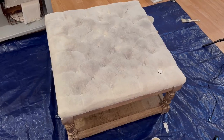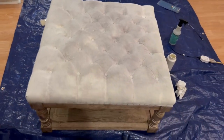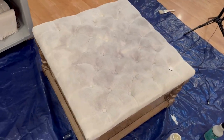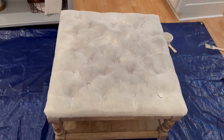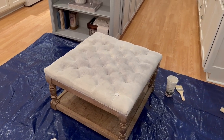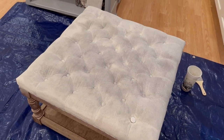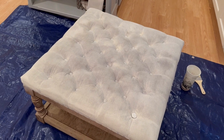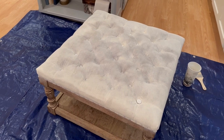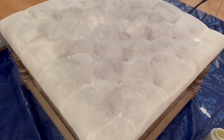This is what we've got so far. It's a little splotchy, but I think it's pretty wet right now and as it dries it will even out the color. I've never done this before so I don't really know what to expect, but that is the first coat. I'm going to let it dry overnight, then I'm supposed to sand it to get rid of the roughness of chalk paint, and then we'll do the process again. I think we'll need to do it maybe three or four times before it gets to be a real solid white.